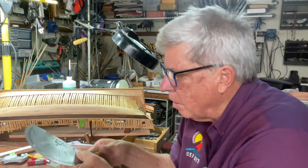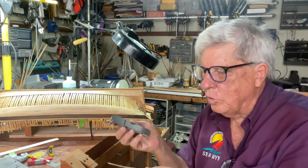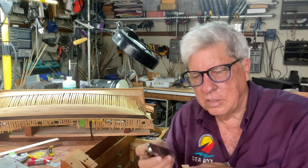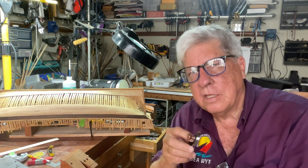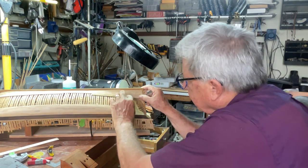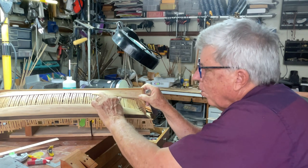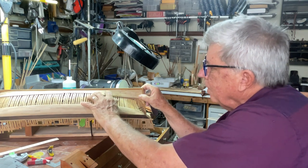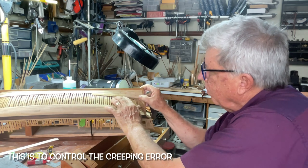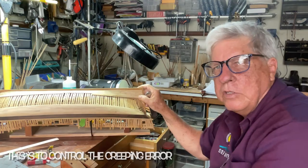And so now you can come back and either sand it. I really enjoy using the plane because I end up with a nice level surface. And so we're now going to take that down quite a bit. And again, just to confirm, we're taking down the bottom piece because we have our reference line at the bottom to guide us through. So we've got a perfect fit on this side. So we just need to take it down, in this case, about a 16th of an inch.